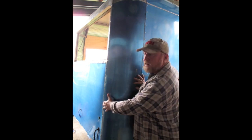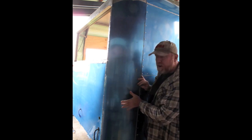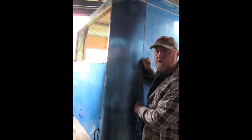When it comes to doing these corner sections, we basically pin the sheet along the edge and then slowly wrap it around. We use ratchet straps and clamps down one side to hold it in position until we pin it with the rivets.